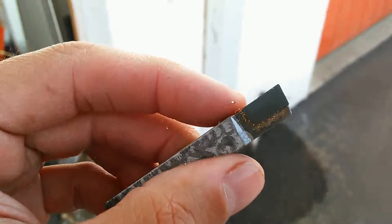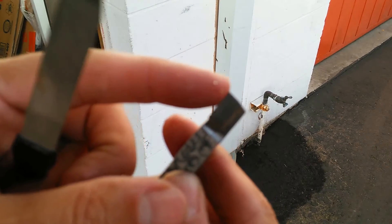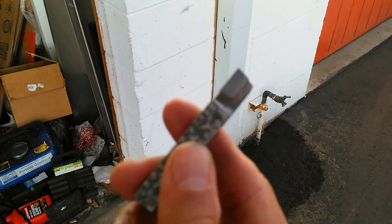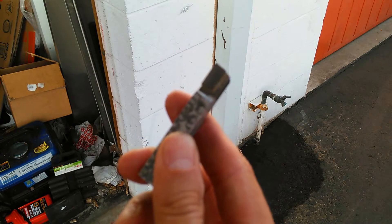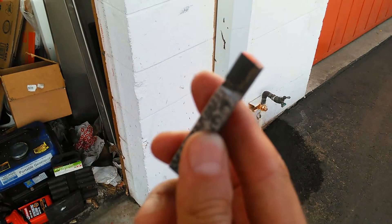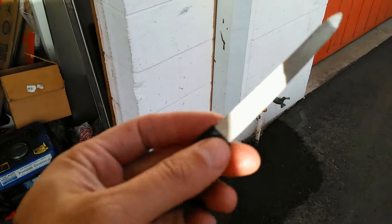This is a video for a backyard machinist like myself. The front edge got dull - it should feel like you could almost get cut if you pressed your finger on it hard enough. When you file it down, it's going to give it a sharper edge, the type of edge needed to cut through the material. I'll also use some lubricant to help it along. Cutting oil is probably the best, though you can use WD-40 - if you're doing higher speeds, spray it onto the actual piece being cut.